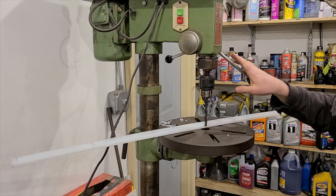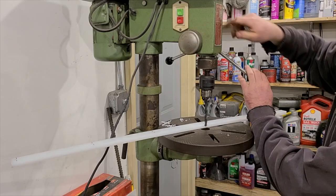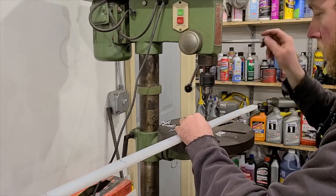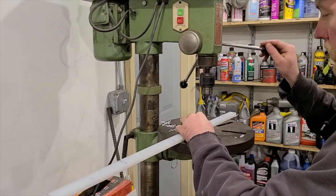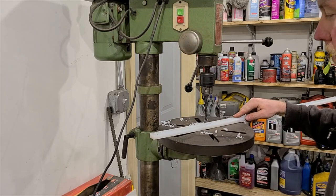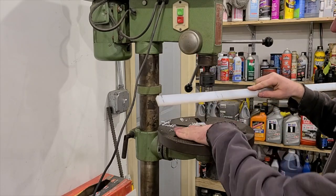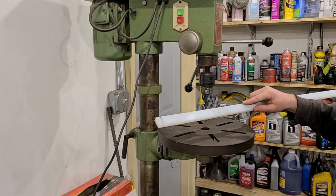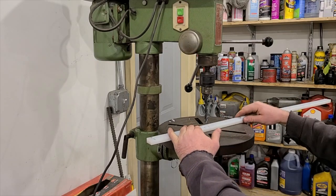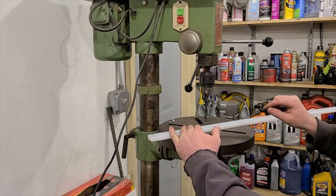As you can see, it hits a break and won't allow me to over-drill. I'll make sure that's nice and secure and then run back through all of these and re-drill them. If you've been looking for an excuse to buy a drill press, this is it — even a cheap one works great for projects like this. One thing to keep in mind: hold it really tight or use a clamp, because if the piece lifts as it catches on the drill bit, it'll over-drill your hole.